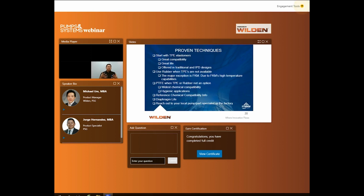All right, so lastly, we're going to give you some proven techniques that you can store in your back pocket, to give you really good direction on what kind of diaphragms you want to look into. Typically a really good starting point is to start with your TPEs. Your TPE elastomers have really great compatibility, great life, and they're offered in the traditional and IPD designs. Rubbers, you would use when TPEs are not available. And like we mentioned earlier, the major exception is going to be your FKM, due to the FKM's high temperature capabilities.